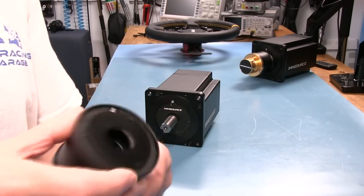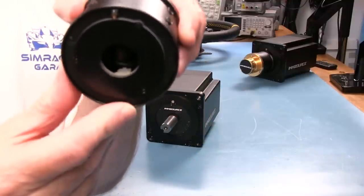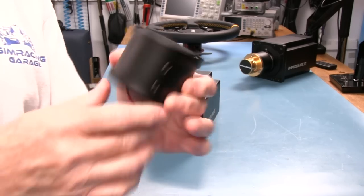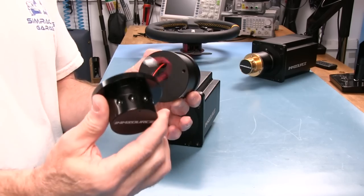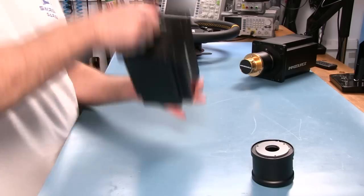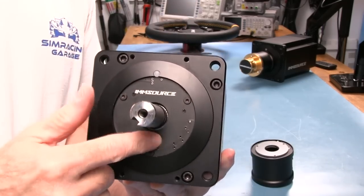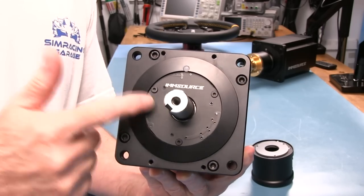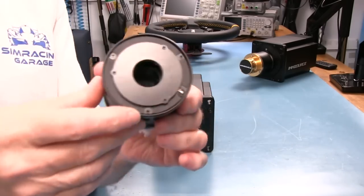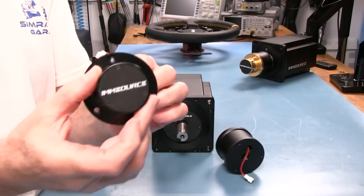And you can see on the back here, these wires are going back to another coil. Let me show you the plug down in there. I think you can see a little white plug. So it's getting current flow induced in it and then sending it down the wires to here. Now, because this is obviously another coil, we have another coil embedded in the wheelbase itself around the motor shaft in here, and of course an electronics package that will supply the current. So again, the current will be induced in here and electromagnetically coupled into the coil on the back of the hub, which is transferred to the wires, and then we transfer it over here to our adapter.